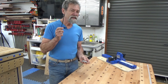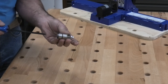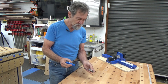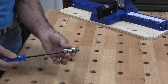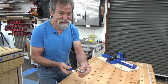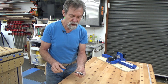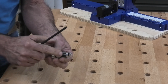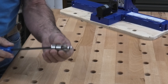I'm going to show you all about it. The clever thing about these TSO power lock dogs is they have an off-center stainless steel bolt with a 5mm hex socket. Use a 5mm hex driver to activate it. Watch it while I turn it counterclockwise and then clockwise. That post is stopping a full rotation. As I turn clockwise it brings this section of the power lock dog out past the 20mm cylinder. When I turn it counterclockwise it brings it back within the cylinder — and that is the big secret.